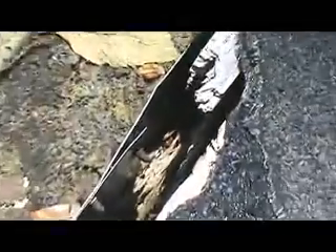I'm on the back of the house. As you're facing the back, the left-hand side, we need to take up at least three courses of shingles over to the valley, because shingles have been — it looks like a squirrel or something got at them. And the fascia board's eaten away. We also need to tear out around the skylight and re-flash it, because there's a leak right here in the corner.